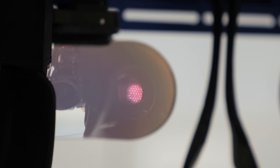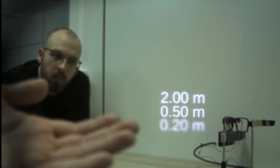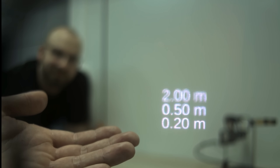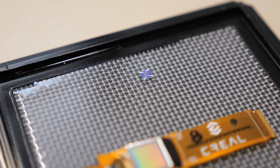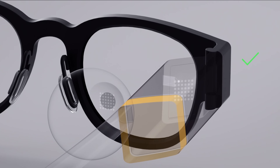Each of these pinholes projects the same 3D scene from a slightly different perspective, with all objects shifted relative to each other a tiny bit. This is enough to trick your brain — or even a camera — into seeing images that appear to have real depth. And what's even more fun is that all of these projections are actually done with one single projector and a MEMS mirror — a tiny electronically controlled mirror that can very rapidly change its orientation. The projector can output up to 8,000 images per second, which the MEMS mirror rapidly directs to the various pinholes, fast enough to trick your brain into seeing a final video at about 240 frames per second. How insanely cool is that?